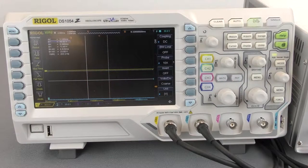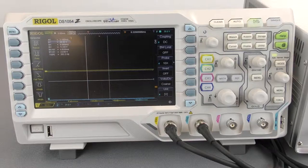If you wish to use an oscilloscope, I would recommend a minimum of 20 megahertz. In this video, we're using a 50 megahertz oscilloscope. You can use either the XY mode or, as we have set up here, the two-channel mode.